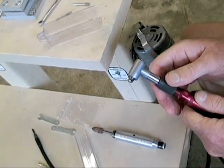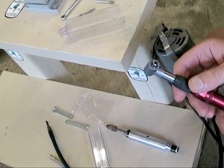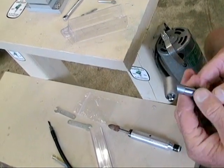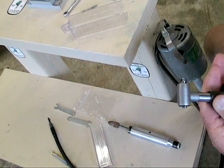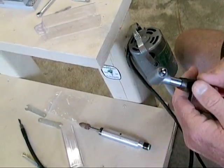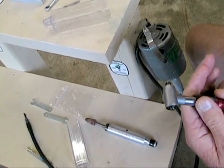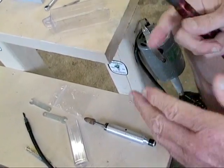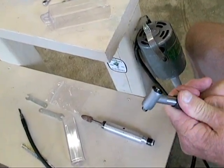As far as lubricating the head, I lubricate them here when I put them together. I would wait before you put probably 10, 15, 20 hours on it, and then you can lube it lightly. I mix our regular grease that comes with our hand pieces and motor with about half and half oil and grease, to make it quite a bit thinner. Just a regular grease you want.